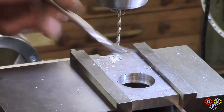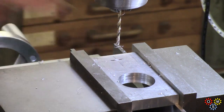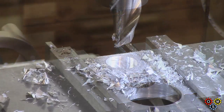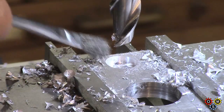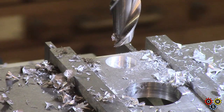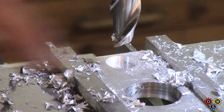There's not really absolute necessity to put the magnet into a pocket in the material, but I think I will for one or two reasons. I've actually got a new five-eighths center-cut end mill which should do the job for that, so I'll get that set up. Needed a slightly more positive feed on that cutter — it was doing quite well. Still a bit of vibration, but we've got a fairly reasonable pocket in there. So we'll take this out, cut the profiles, and then work on this end for the cinch bolt.